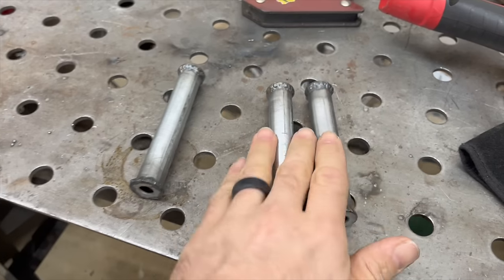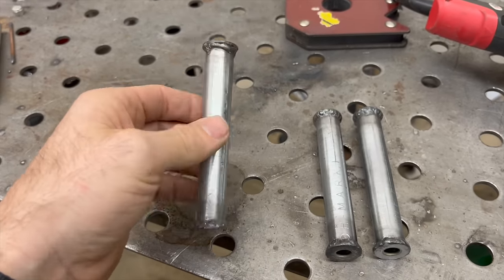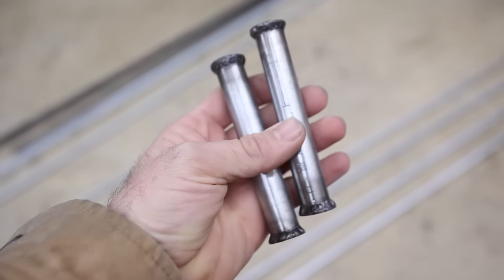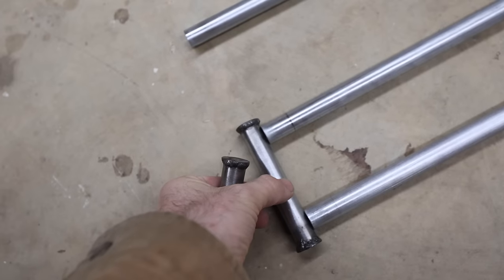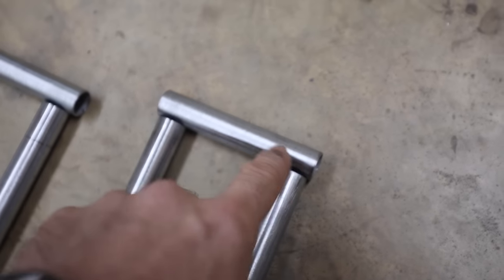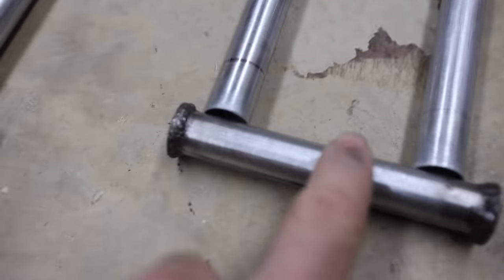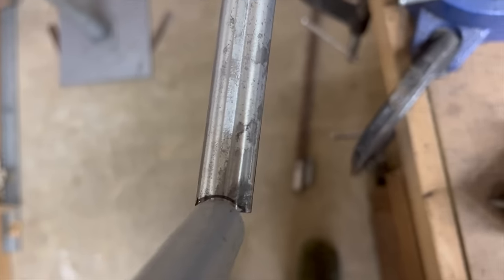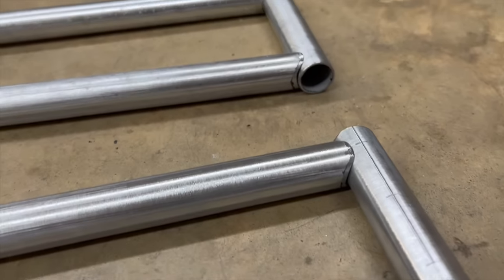I'm going to use those two good pieces for the two identical arms. The third arm will be the same thickness on the hinge side but shaped differently — I'll show that as I go. Our four and three-eighths pieces are now four and a half after welding. I'm going to notch these pieces so they fit the round conduit surface nicely on both sides, eliminating any gaps. Look how much better that looks.